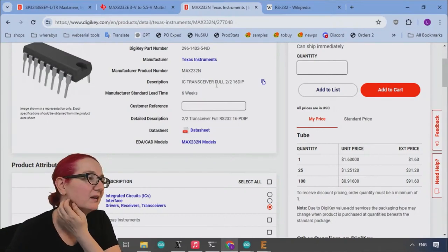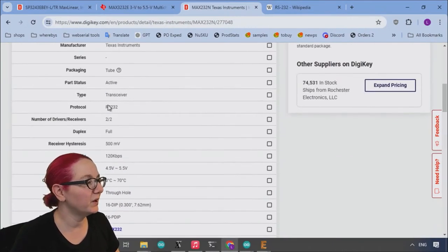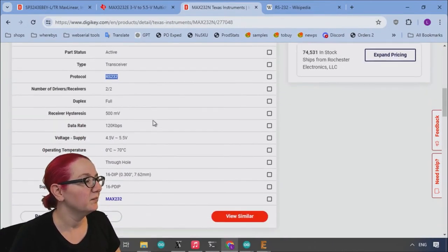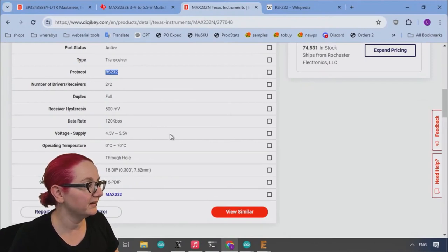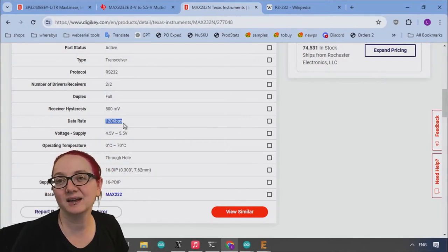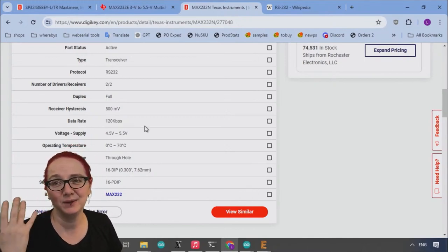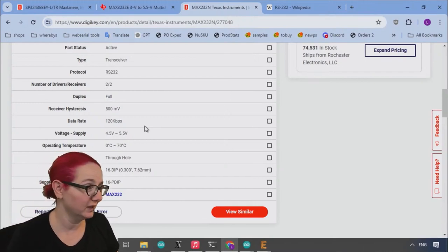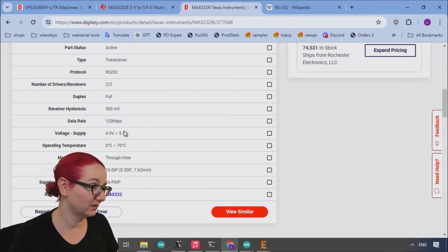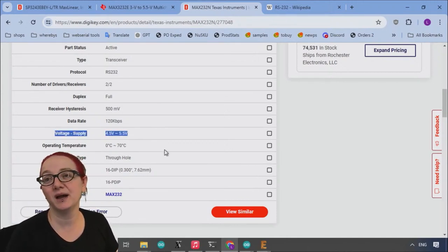The one thing that's a little annoying about the MAX-232 is it's limited — it can do 115 kilobits per second. That's why it's data-rated for 120, because it's a little bit over 115. But there are times when you want to communicate at 250 kilobits, which is not unusual. Also, this one has a voltage supply of only 5 volts, because at the time a lot of people still ran their microcontrollers at 5.